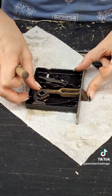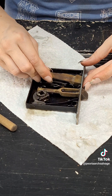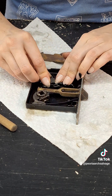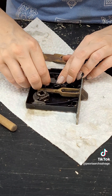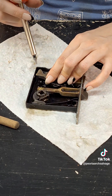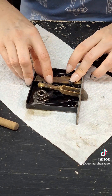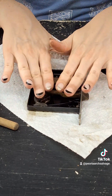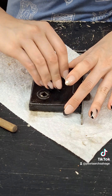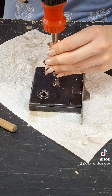You can see that it's moving well and everything's oiled. This one's going to be a little trickier because it's got that spring working against you, so just take your time. Put the front end in — it's going to want to pop off, that's okay, it might take a few tries. Make sure that little steel bar and the spring are in the right place; you might want your screwdriver for this. Once everything's back in, go ahead and close your lock back up. Don't lose your screw, and do not over-tighten it — hand tight is fine.